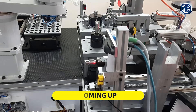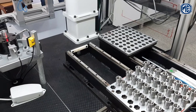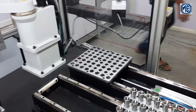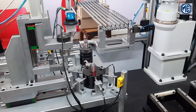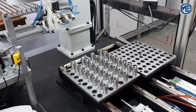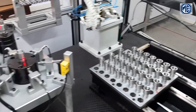We will now look into the whole process of inspection in detail. This multi-gauge is a robot-operated three-station gauge; however, one operator is needed to load the part into the pallet and to remove the part from the output chute. Once the pallet is filled and acknowledged by the operator, the pallet moves to the pickup position and the robot picks up the part and loads it.